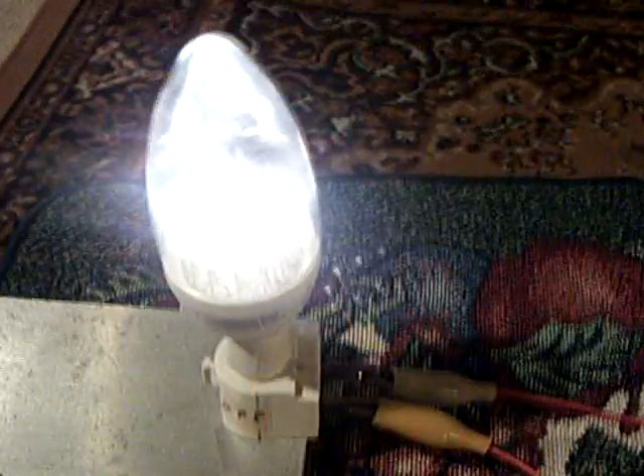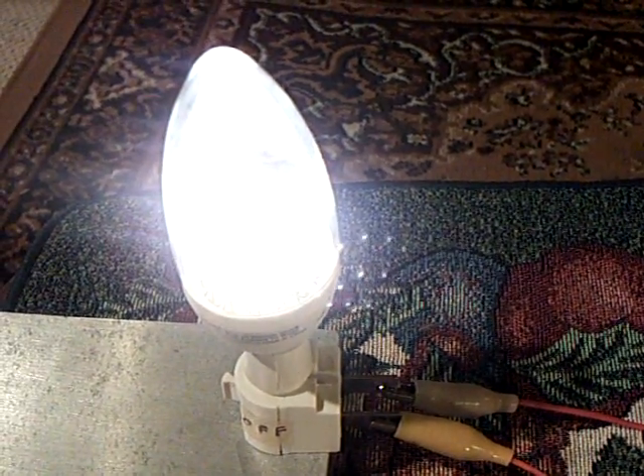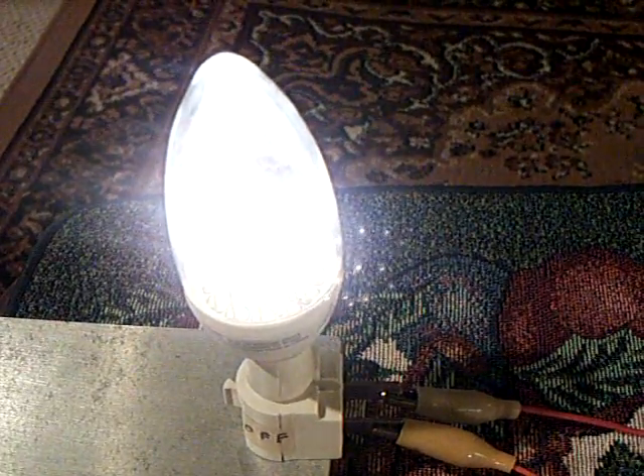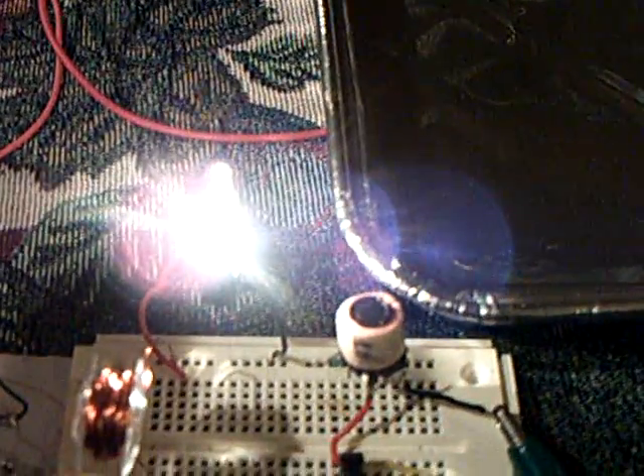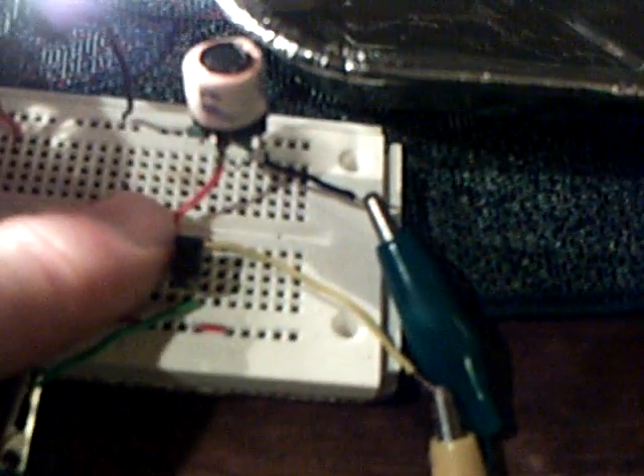And not blow up your transistors, if you do it right. I'm going to crank the voltage up a little bit — you should be able to see this get brighter. It's kind of hard because the camera's compensating, but as I crank up on this rheostat, everything gets a lot brighter. You can see it on that bulb right down there. This bulb's kind of neat because it adds light to the whole scenario and shows me the amp draw, which is quite a bit — probably 300 to 500 milliamps. That's a lot. But I am getting a lot of light out of this for that, and I seem to be able to handle it with these little transistors.